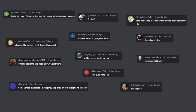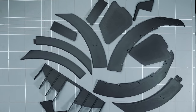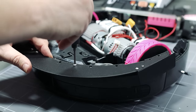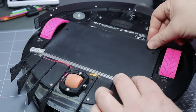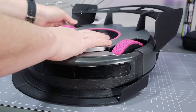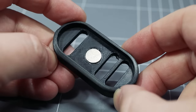A spoiler was one of the most requested upgrades. This has been done before, but I took it a step further and designed a full aero kit, then printed it in nylon carbon fibre. The diffuser attaches to the dustbin. There is a splitter for the front. This piece tidies up the airflow underneath and also doubles as a chassis brace to stiffen things up. And of course a completely over-the-top wing for the rear. I had problems with my onboard camera mount last time out, so I repurposed one of my other designs to make a more aerodynamic mount for the front of the Roomba.